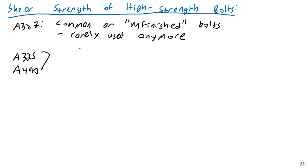When I say A325 and A490, for our purposes here there are some distinctions, but basically they are just different material properties. These are what we call high strength bolts — very highly designed, high quality, high strength bolts. They do actually have quite high strength. As compared to most structural steel materials where we deal with ultimate strengths in the 50–80 KSI range for A36, A992, etc., high strength bolts typically have an ultimate tensile stress equal to 100 to 150 KSI — quite high.